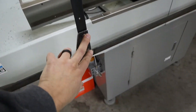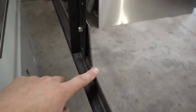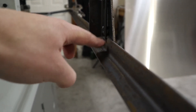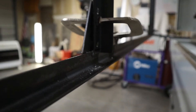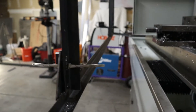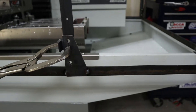What I did was take these two bolts back out and let this piece go inward so that it wasn't sitting on the top lip of the angle anymore. You can see it actually dropped like an eighth of an inch or so on this side — and then on the other side it was actually even worse. So I grabbed a piece of scrap angle that's an eighth inch thick, clamped it inside here so that stuff wouldn't bend, and then used my existing bracket as a drill guide to fix the holes.